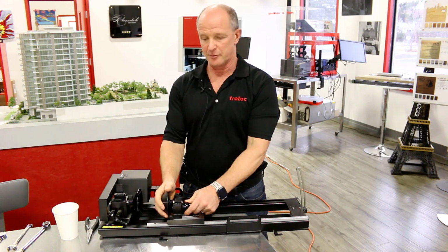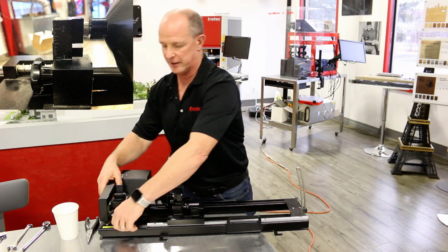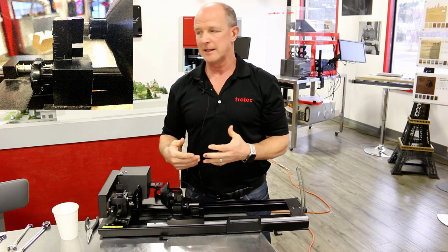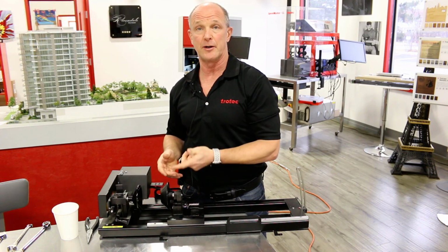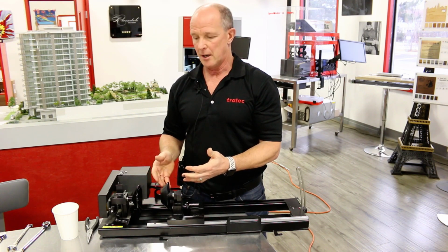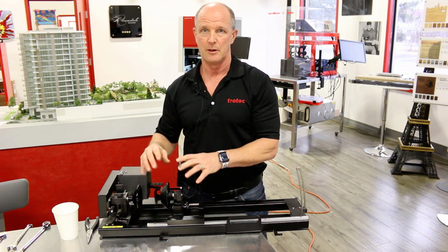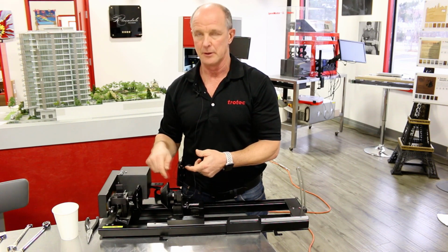This back is adjustable. So again, if I want to bring the rotary attachment up, I can. I can adjust here too, so I can bring that up. And that allows me to clear a handle if I wanted to go all the way around. If it's lowered down too far, the problem is that the handle's going to catch as the actual mug turns all the way around.